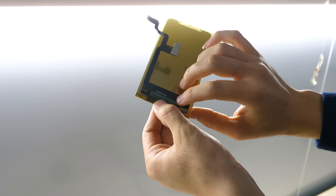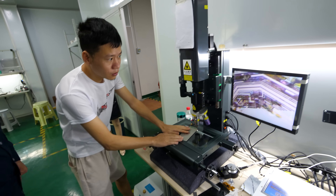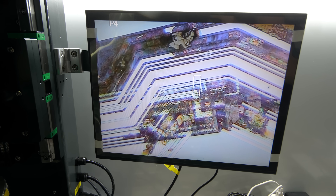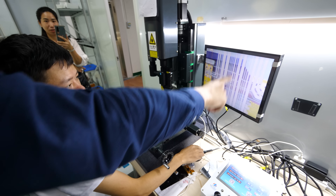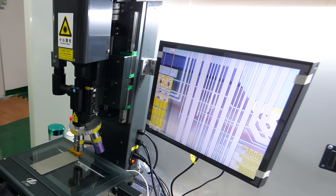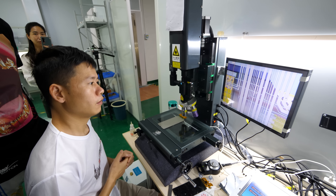After you fix it, you put a new glass on it and nobody will know — it's as good as new. This is water damage — a kind of corrosion — causing lines inside the glass. It doesn't look beautiful when you fix it, kind of like a weld looks dark, but it's fixed. The original lines are here and where the laser was drawn you can see it became kind of black — oxidized — because the traces are made of copper.